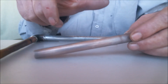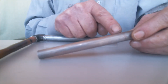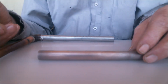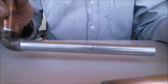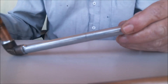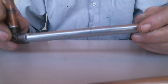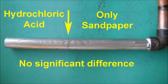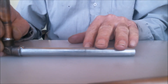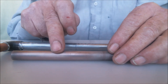We should have this in mind when sizing the pipe. Also, it didn't deposit tin under the cathode wiring, and in general it has a copper hue that shows that not enough tin has been deposited — and this after an hour with 4.5 volts. With the emergency method, there are some streaks of solder or tin along the surface, but it covers all the length of the pipe and shines quite nicely. Additionally, it only takes 10 or 15 minutes to produce. In general, I would say the emergency method works much better than the electrolytic method with these materials.